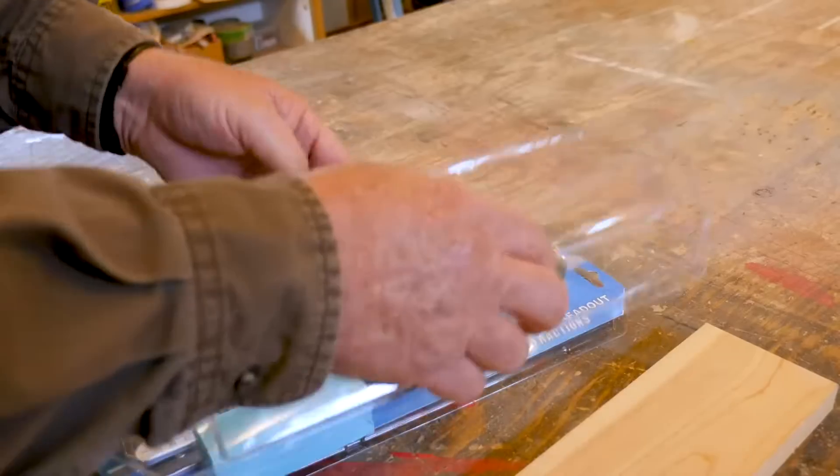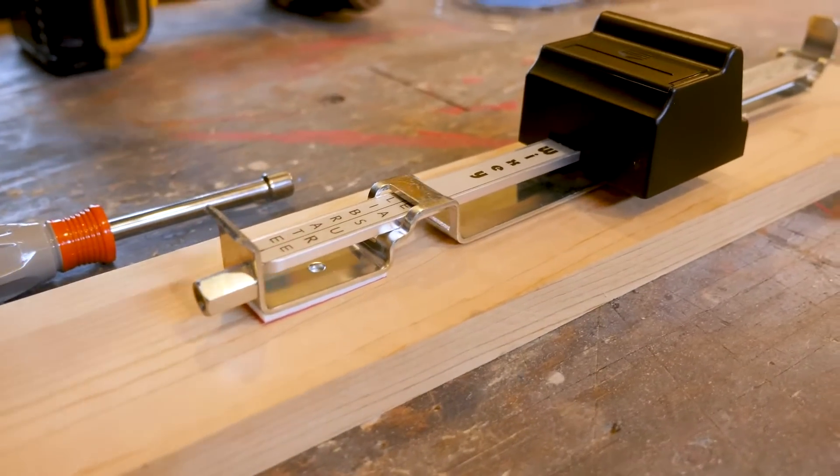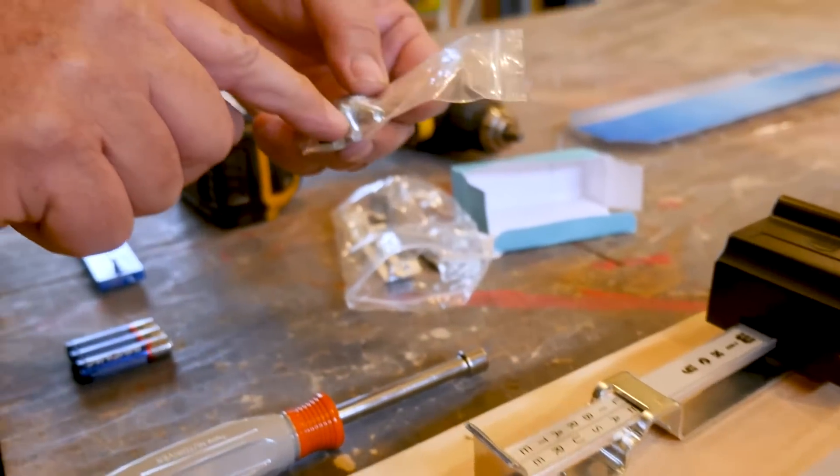Let's get this unpackaged. There's an adjustment nut or a welded-on nut at the bottom. Take one of the provided jam nuts — in this case, we'll use the short one — and insert several turns. You're not actually going to use this as an adjustment, but it gives you a place to rest the bracket on. Then take the whole unit and place it over the existing scale. Use a block of wood below and a straight edge to raise it until the foot is in line with the adjacent planer bed table.